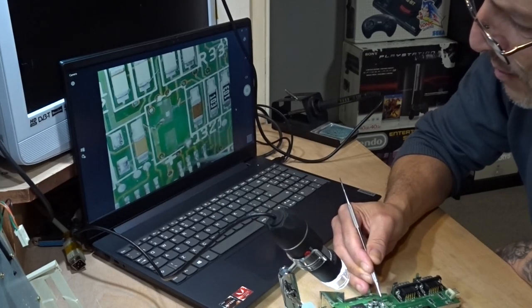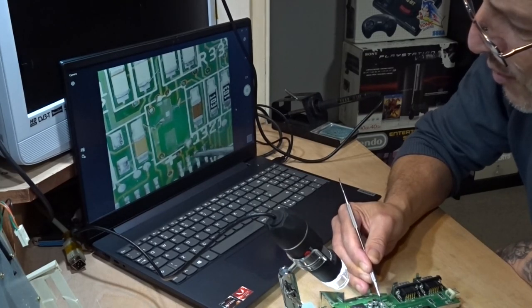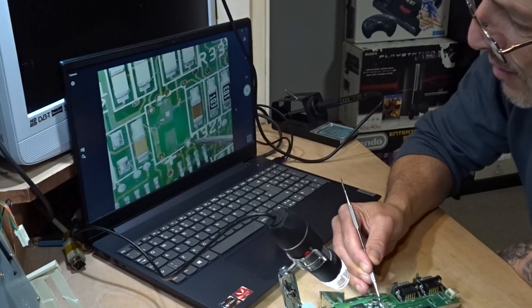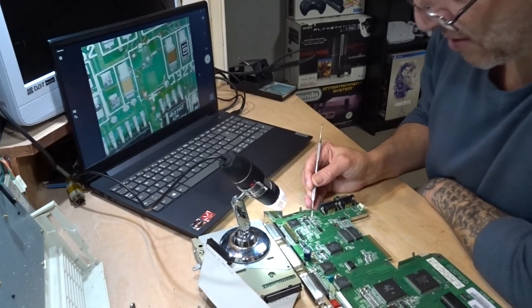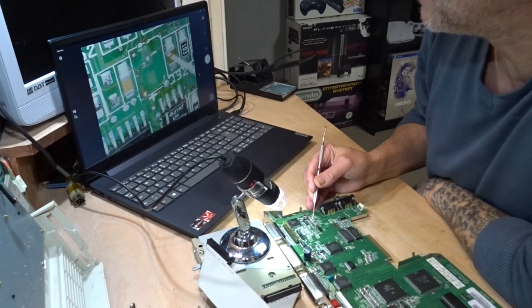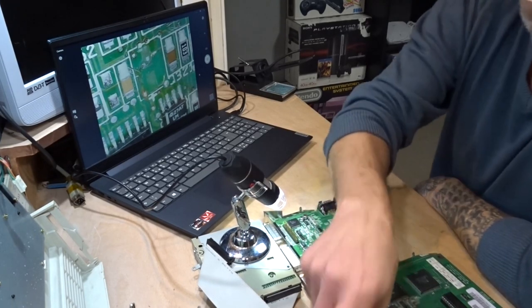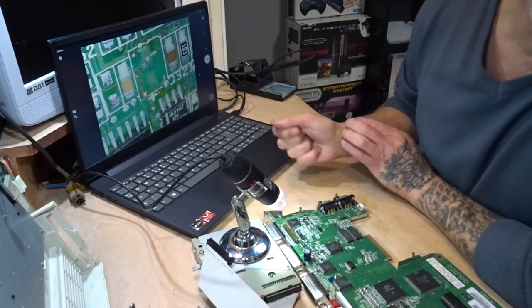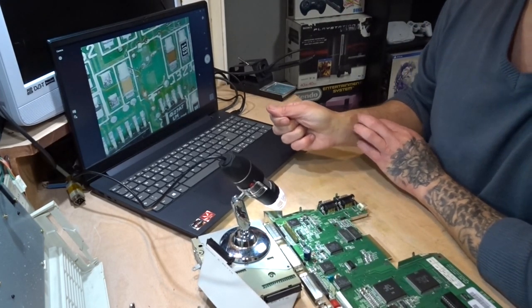The positive capacitor here goes to these two pins here on the 555. So try and get it lined up with that wire and this here. And so these two need to be soldered up together, that and that one. So we're going to have to bridge that with a little bit of wire. Great.